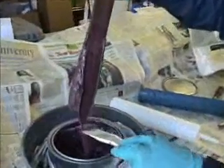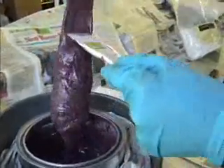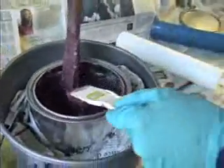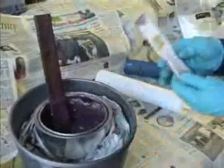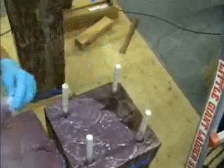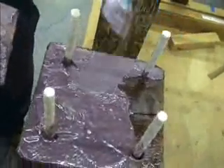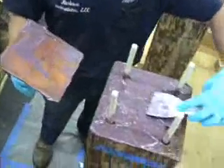We're testing the consistency here. We're mixing it a little bit thin so we haven't used too much thickener. This is because we want to make sure we have a lot of resin in the joint that we're using it on. We're applying it right on top of the number 100 consolidant, preparing the joint to be put together.